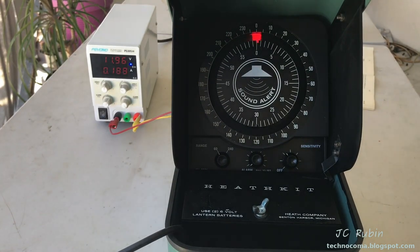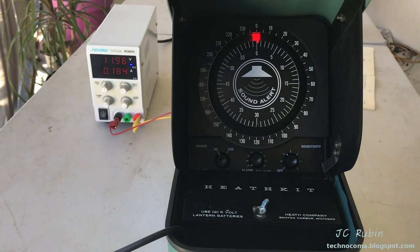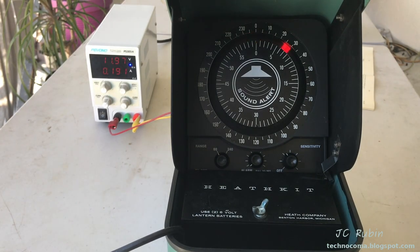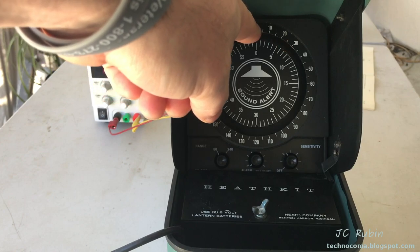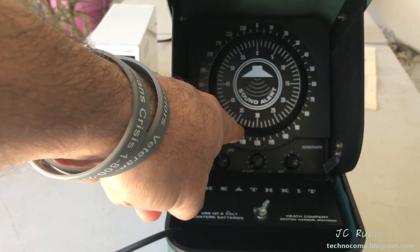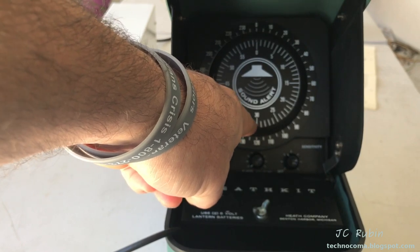I'm trying to balance the sensitivity with the actual test. He's moving the transducer in the pool — right now he's got his finger in front of it. It has to pitch down a little bit because there's an angle. I bring up sensitivity just a hair — there we go, we can see it right there. We're looking at about 30 feet scanning across the end of the pool. It's about a 30-foot pool and we can see it kicked up. Now he's against the wall — a 7-foot distance from edge to edge. Now it's pointing straight to the bottom of the first step, just a couple of feet down, and we can see that has picked up. He's scanning around the pool and as he moves it to different areas you can see some recurring numbers. There's the 30-foot reading as he's at the edge of the pool on the opposite side.